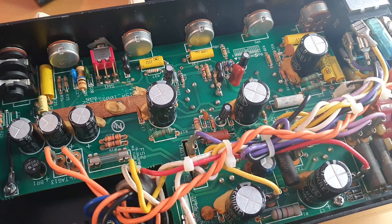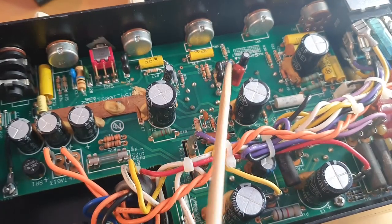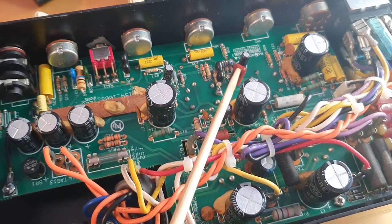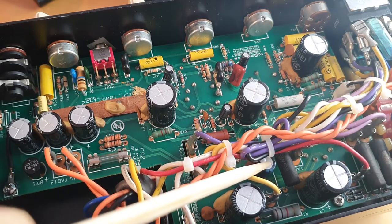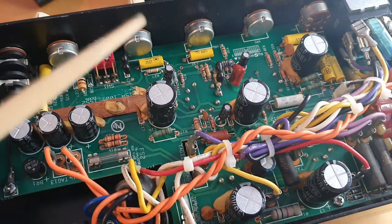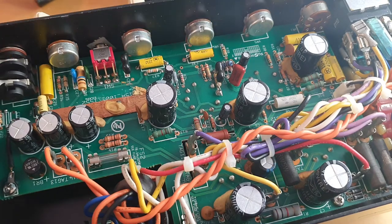The original one was, I think, 10 microfarads and 400 volts — so that's not original. This cap was added, this resistor was added here. A different value cap: this was 2.2 nanofarad, now it's 22 nanofarad, with some resistor. This cap was changed — it's a cathode cap for the power tubes. A few more things were done here; this resistor is not original. They are all good quality, good ratings, but someone's been here already.